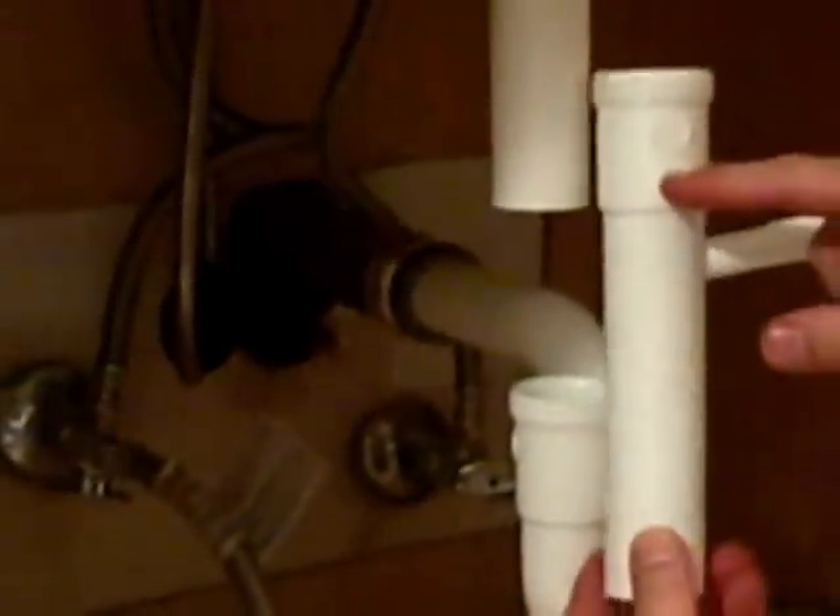On the tail piece with a plastic P-trap like this, it has a beveled end and your nut sets down on this beveled end — you don't need a washer at all here. This is one area where sometimes people get confused and try putting a washer here. We're going to slip this in to where it lines up, and you can see how deep this pipe slips down. Now it slips down into the next section. I'm going to give us a little room, make a mark here, and that's going to line up real nice. I'll cut this with a hacksaw and then slip it in and get our spacing.